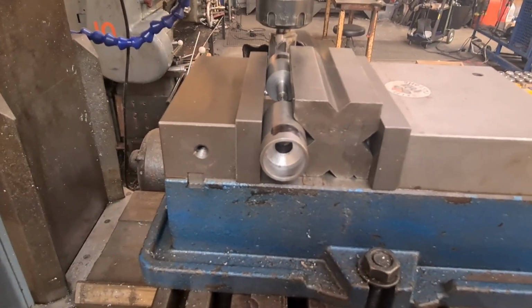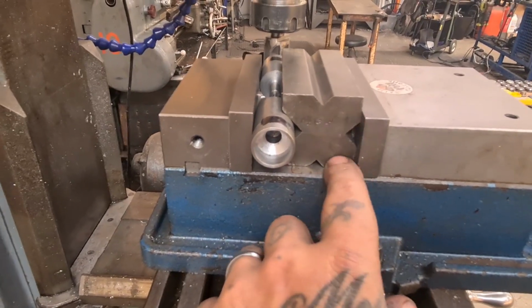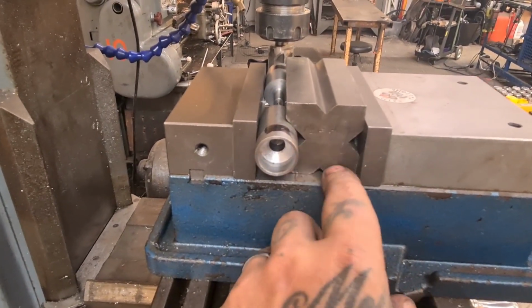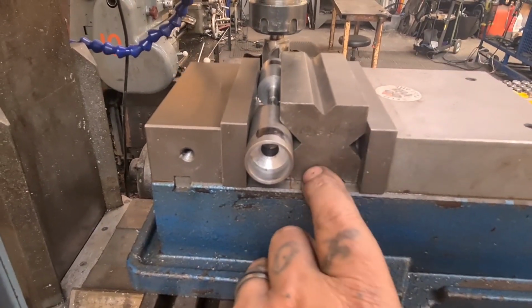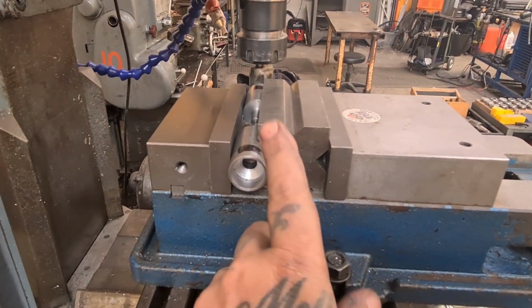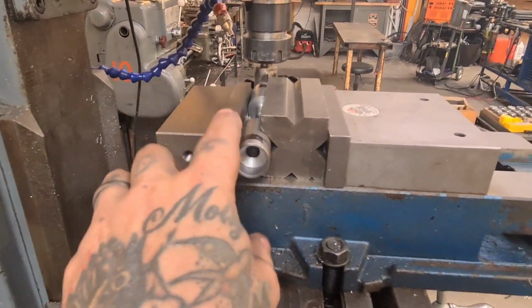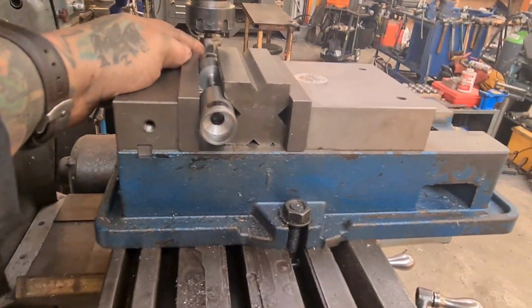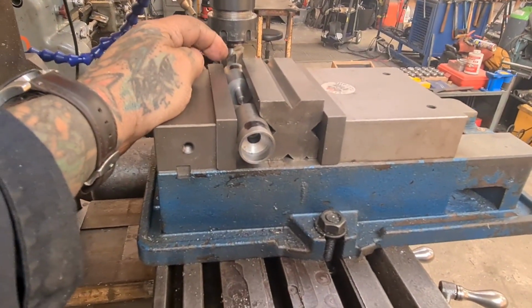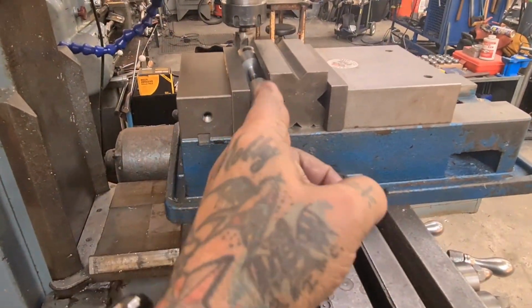So I've got a V-block, sorry. It looks like an X. I don't know why I said that. Well, I do, because it looks like an X. So we've got an X block. We've got a V-block there holding it on the back jaw. And we're hard against this, the moving jaw, hard against the back jaw, the fixed jaw. And I've set the cut off for 25mm off the outside edge, so it's on centre with these parts.